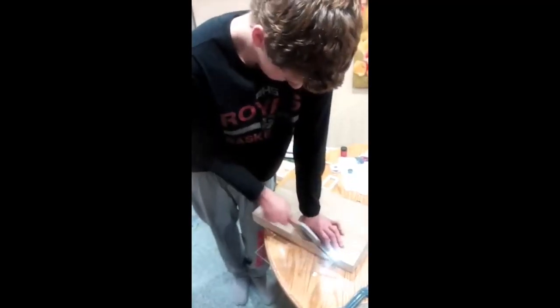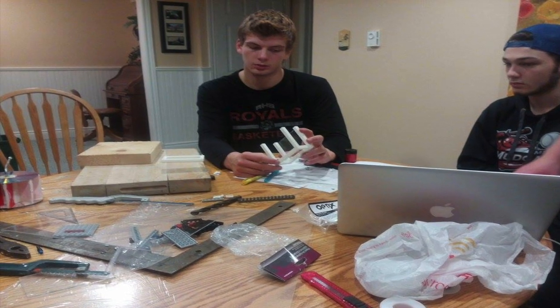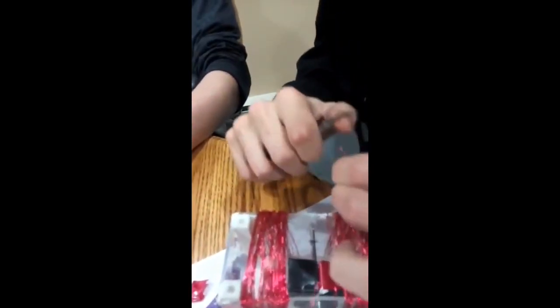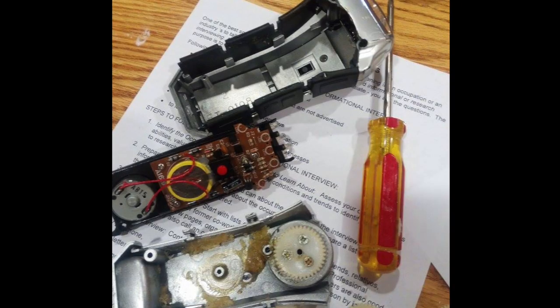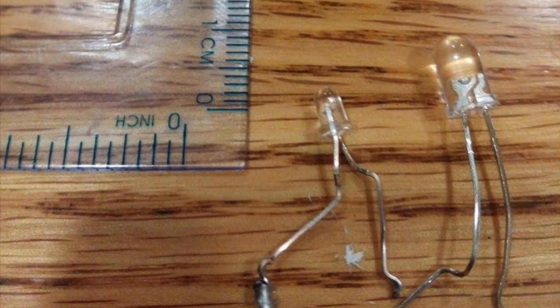After having our 3D printed design, we cut out some plexiglass to use as windows to protect our magnet. It was quite challenging and we did break a lot of pieces trying to drill holes in, but overall we got the box finished, and after that we just had to wrap the box in magnetic wire. We shaved off the red coating to expose the copper wire so it could conduct electricity through the light. Next, we took apart our rechargeable flashlights to examine their generators and salvage their light bulbs.